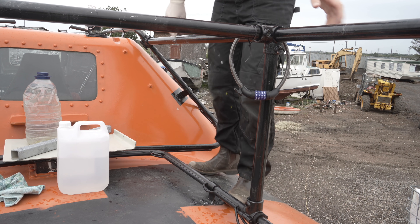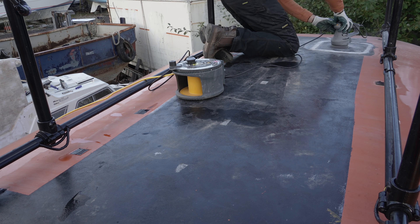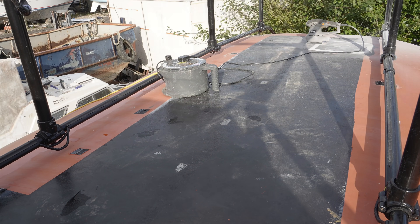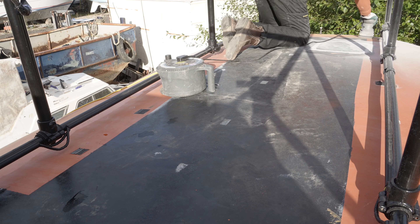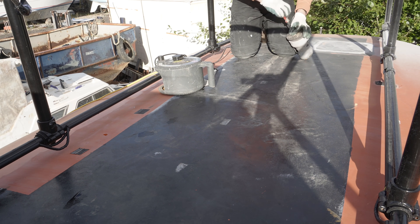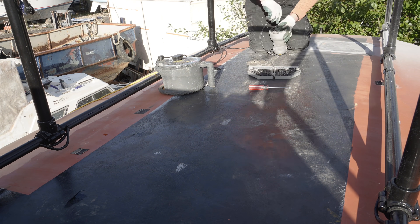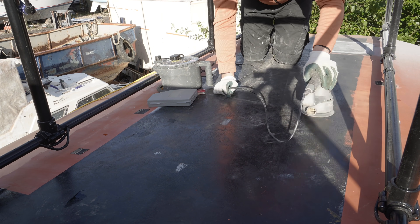Months and months ago I put down a basic anti-slip with normal marine paint, but I want to extend it and use a more resilient coating. Naturally, this meant plenty of sanding, and I have to break some bad news. This was the last stand for my trusty orbital sander, which I thought had minor issues in the last episode. It turned out it was even more unhappy than I thought. First the sanding pad screws loosened, then again having been retightened, a hex bolt loosened and punched straight through the sanding disc. Finally, having reassembled everything, there was smoke and the smell of burning. It turned out the seals and some of the innards had nearly caught fire. There were no obvious blockages, so I'm guessing something wore out and began rubbing.